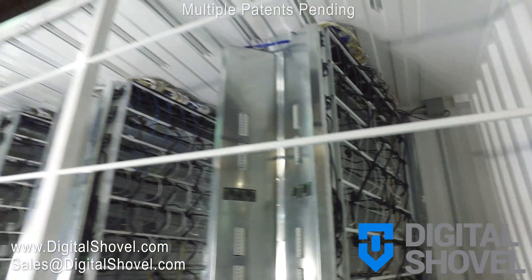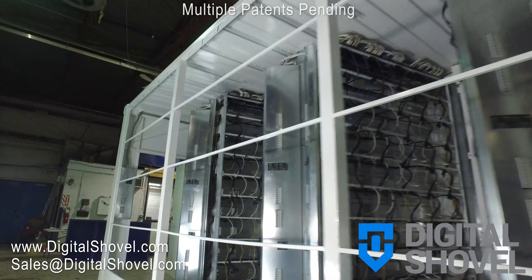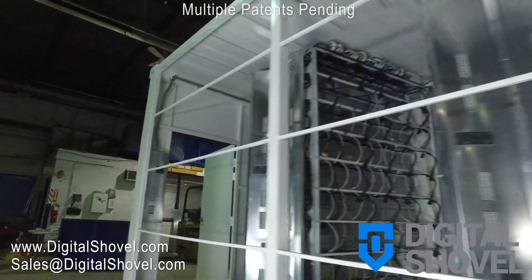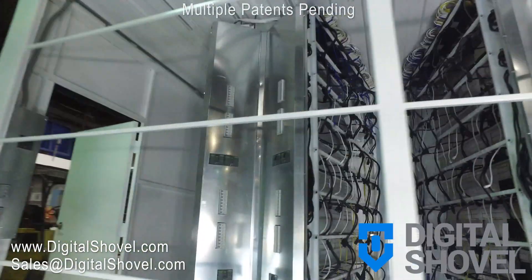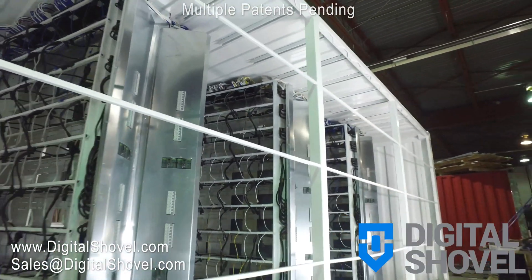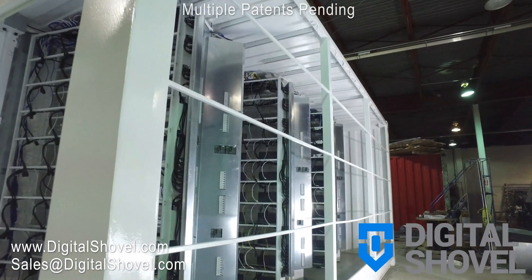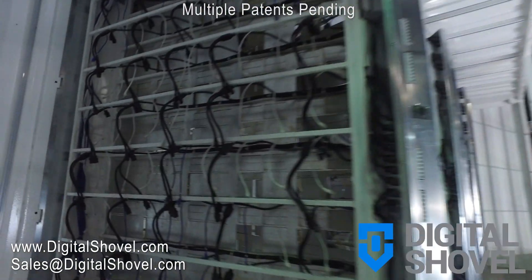This side that I'm shooting from here, although it's wide open, our awning-based intakes go here. They bolt on in the field, which hold your filters and give you a surface area that's almost double the size of the container itself in terms of the intake area, preventing water penetration and increasing the overall throughput of airflow.